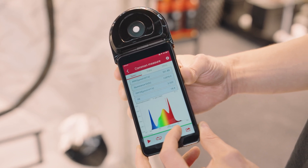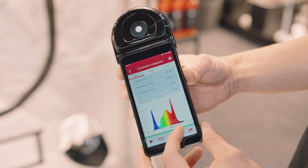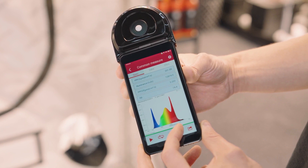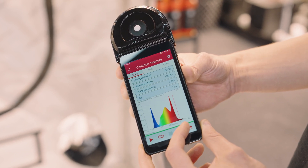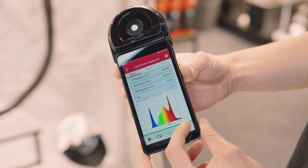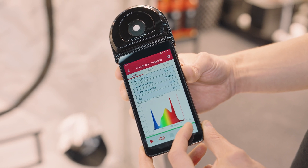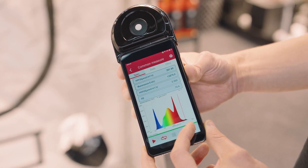The 660nm diodes push the red region further, meaning your plants experience very high levels of red wavelengths to help push fruiting and flowering development. Just beyond that red peak is another small bump in the 730nm range, specifically thanks to those dedicated diodes on these boards. This makes a real difference for fruiting and flowering development, helping to stimulate high levels of photosynthetic growth.